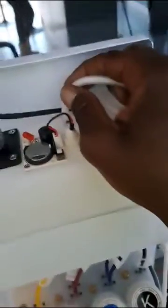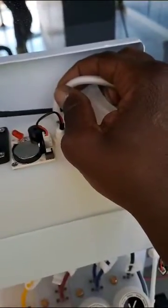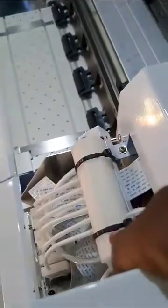Then you plug in a very big syringe and pull white ink. Once the ink starts to reach the syringe, you'll pinch the pipe — pinch the pipe — and then you connect it to the tank to allow complete circulation of white ink, so that the purge canister doesn't run empty.